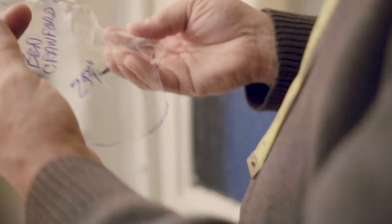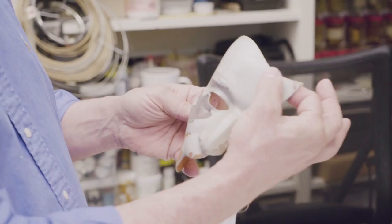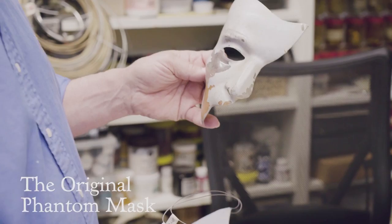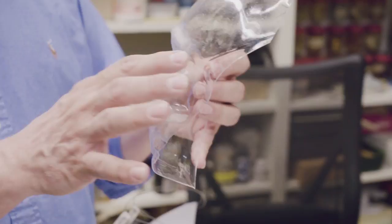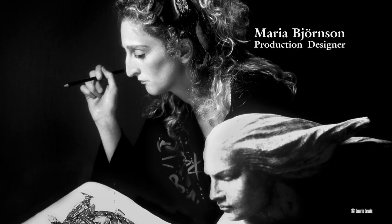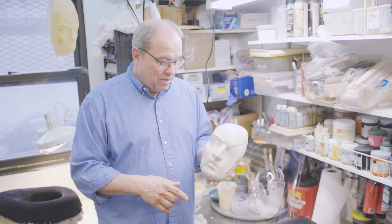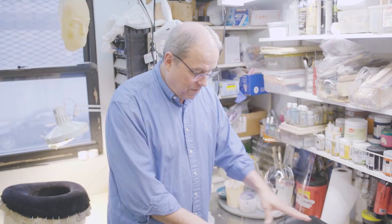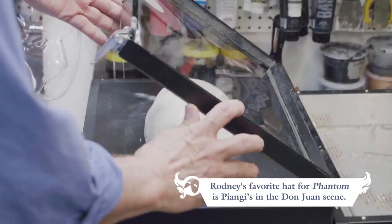It goes with me back to my shop and we use this as our template to copy and make your mask forever. You see how flat it is here compared to what we do now. Maria Bjornsson turned it into more of her nose and she admitted that — she had quite a pronounced profile and she liked it and wanted the Phantom to have the same one, so she gave the Phantom mask her nose. This is the mask we use all the time now and it's set down on this — this is a Vacuform machine. It heats the plastic and then you quickly flip this over; the plastic will be very soft and will give enough, and then you turn on the vacuum so that it sucks the plastic down onto the mask.